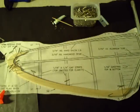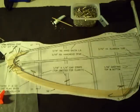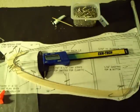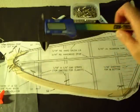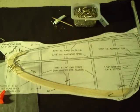Another tool I didn't mention before: I have a digital caliper. The manual ones are fine, but for measuring thickness of wood or shims, a digital caliper can't be beat. I bought this one at Harbor Freight for eight bucks on sale. The only downside is it has a battery and I don't think it shuts itself off, so you may choose to get a manual dial caliper instead — just as good and accomplishes the same thing.